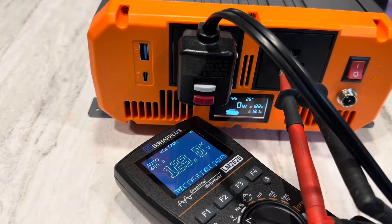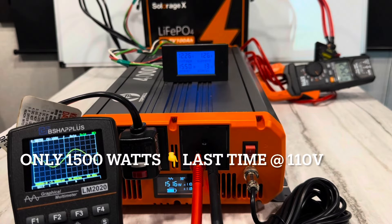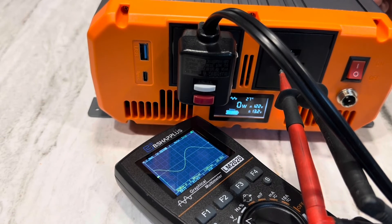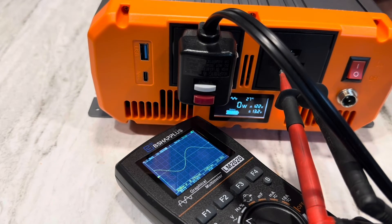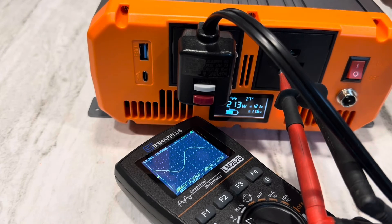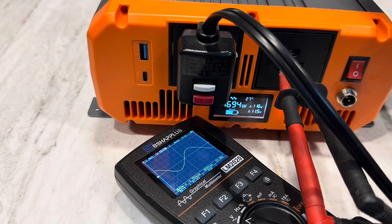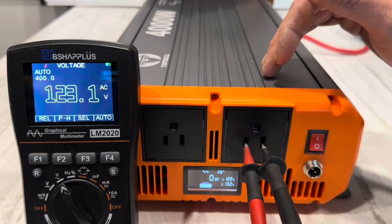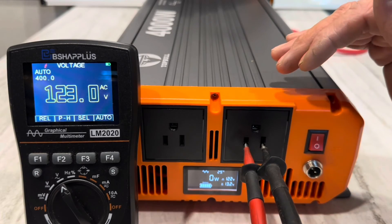There's a quick hit with the resistive load voltage. Now I'm going to check the sine wave — just another quick hit with the resistive load from the hairdryer, just going to watch the sine wave. Shouldn't have any effect bringing the voltage up. Still running 59.960 hertz. Give it just a quick hit. Many of your inverters of this design have that control circuit and potentiometers where you can adjust current, adjust voltage, just things like that.